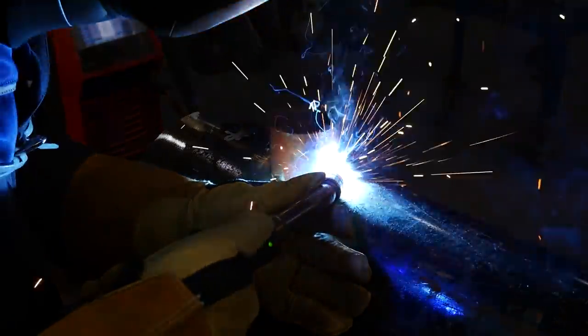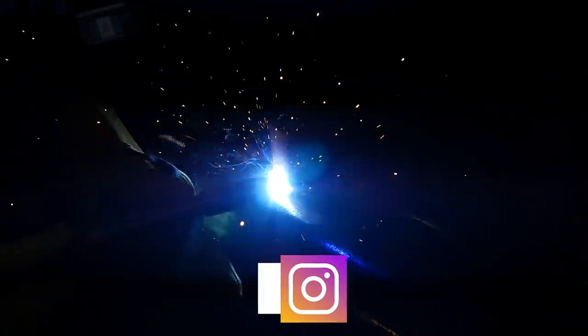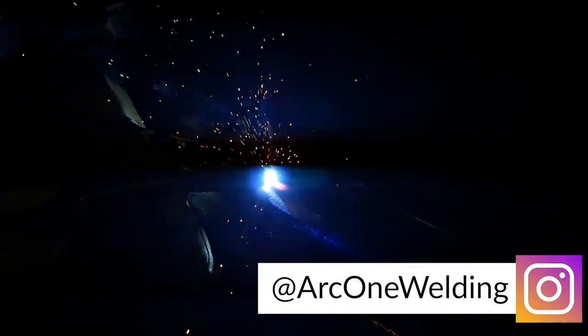Time to weld the socket. So I'm going to do a routing pass, just on the synergic root setting. I've turned the power up on my torch, so I don't know how powerful I'm doing. It's just a peace of mind root run, as you do. Turning it down because I've got a bit more of a bigger gap here.